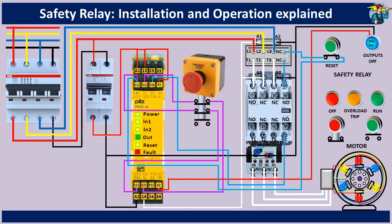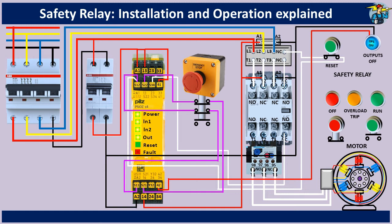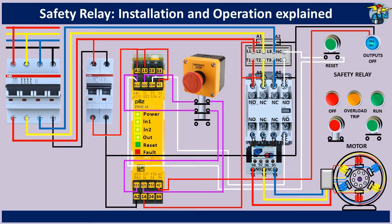The LED indicator for the output is now on, and terminal 14 sends 230 volt control power to the motor run contactors. Before the reset button is released, the reset light goes out because the start loop is now disturbed through the opening of the NC contacts on the contactors. The motor starts running now as the contactors are energized with the control power on. Further, terminal 42 has no power now, so the output shutdown light is off.